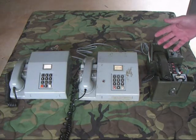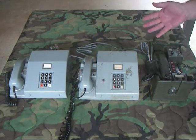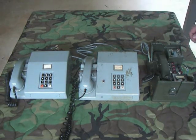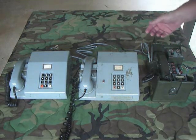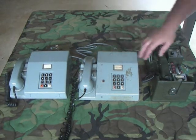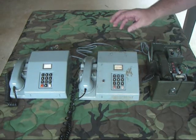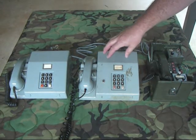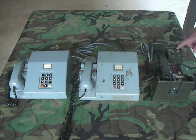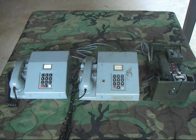We're out on the patio now with our four-wire phones set up — two TA341s and a TA838. All three are set for point-to-point signaling and all have batteries in them using CCL batteries. I have them configured as a four-wire paralleled circuit to demonstrate how this doesn't fully work. Phone B is set to do an aural ring so you can hear it, and phone C is set to do just a visual ring, so you can tell which ones are ringing during different activities.